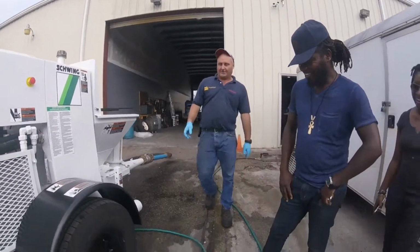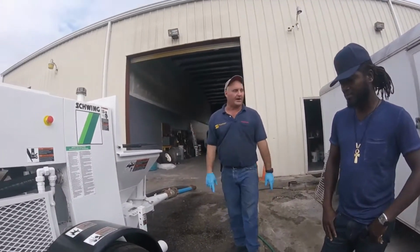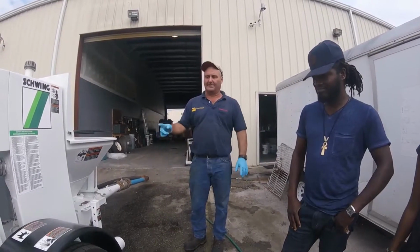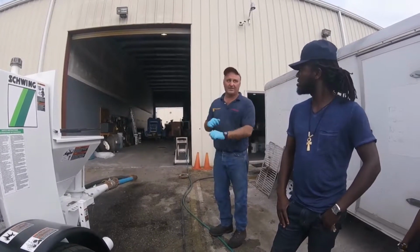It's easy. Right there are 2 grease fittings on each axle, and there is one on S1, but you do that maybe once a year. As the lever gets harder, then you know to grease. Other than that, leave it alone, because it's self-lubricating with hydraulic fluid. If you wash it a lot with acid, you're probably going to have to grease a lot.